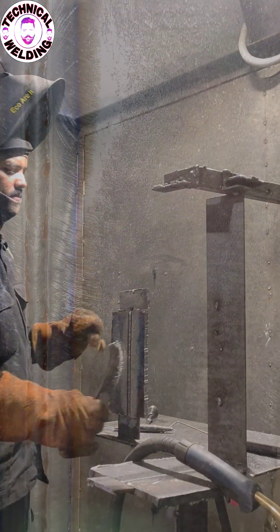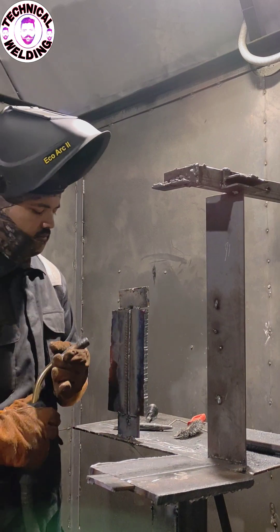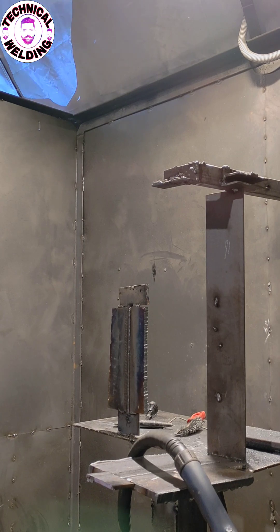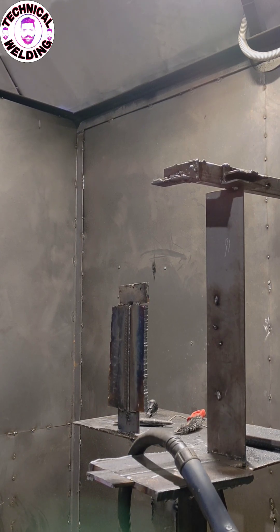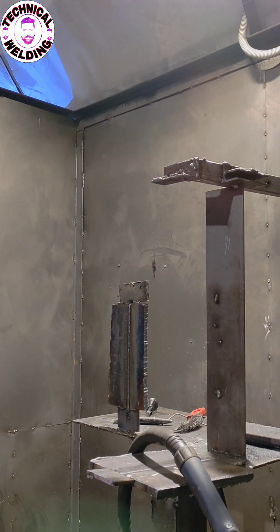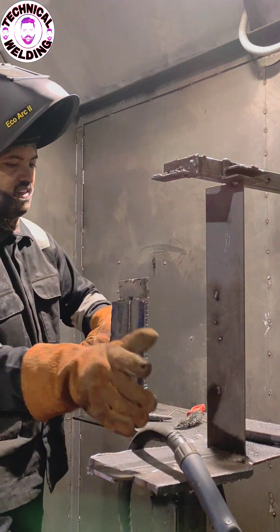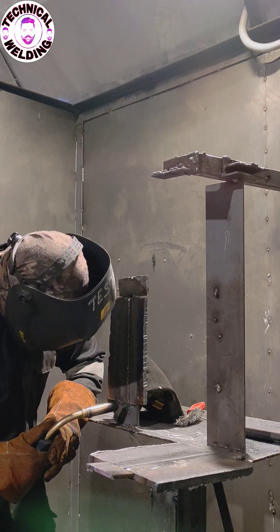Even gas, wire speed, bend of your wire, and power — now capping: I already did one pass and then filled up, and this one is the capping. Now this is the second pass for capping. This plate is too hot, that's why I need gloves. Depend on your power — how much you need. I'm using here 200 ampere and wire speed even 200, sorry almost 190 wire speed and less than 200 ampere. This much is enough for me. When this plate is getting very hot, I can't survive without gloves.